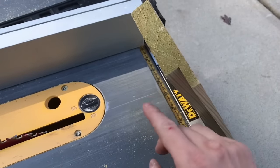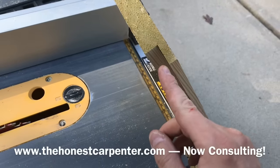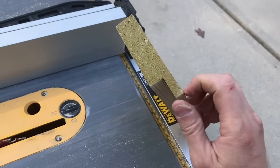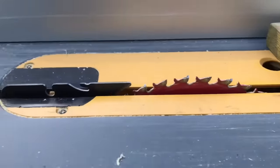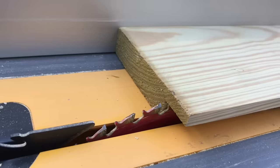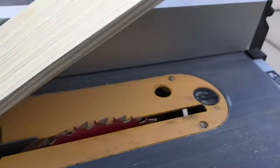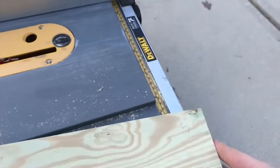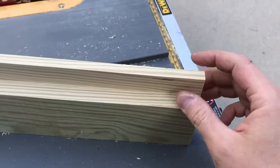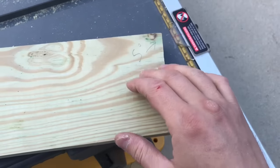This gives you a better idea of what I was describing. We cut this kind of big rabbit in here — this edge points inward toward the house and the weather stripping sits right there. I just did one rip leaving about three-eighths, which is the size of that little tongue, then set the blade depth by eye and made a pass to cut out the excess without cutting into the tongue. Now I can cut this piece to precise length at the top — about 16 inches — make the shims, and I'm almost ready to install.